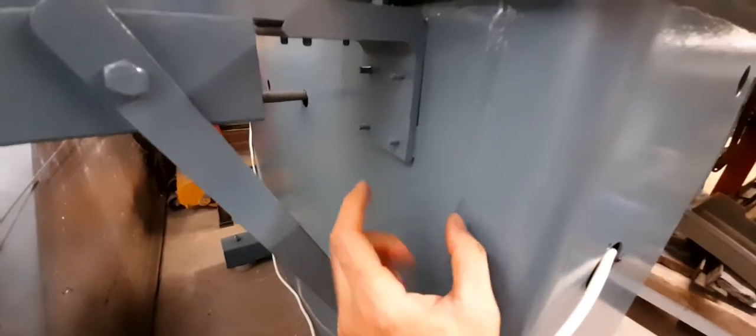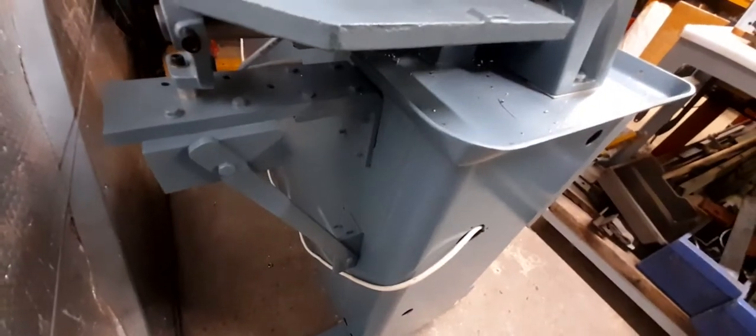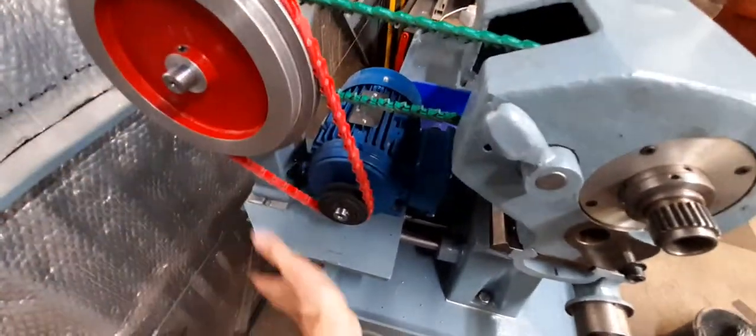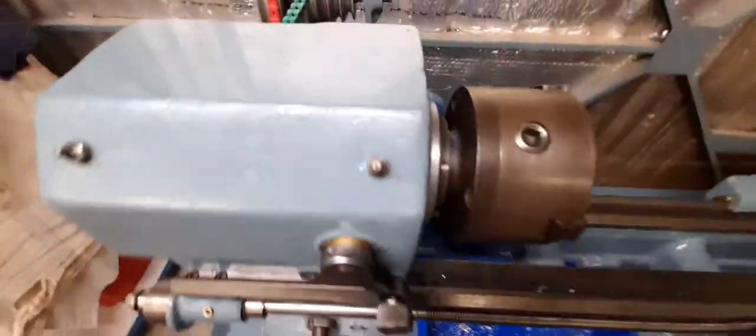So I made new rails, and while I was at it I made new parts to look nicer. The rear of the rails are supported by a bracket. I also beefed up the back of the cabinet — I welded on about 6mm thick plate onto the back. From inside you can see a burn mark in the paint showing where I welded the new plate on the back, just to beef things up and make sure the whole camshaft arrangement was nice and stiff and not subject to bounce.